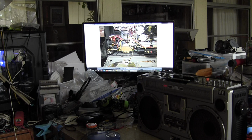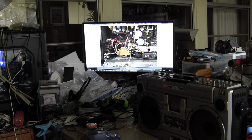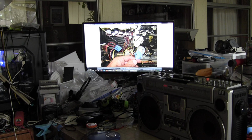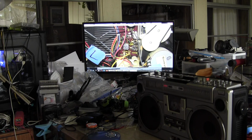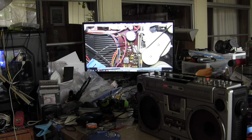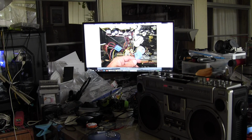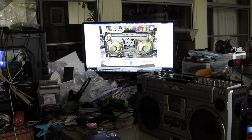Picture of this side where the wires go, because this is very important, because when you go to separate the main front from the back, you need to, anyway. Another picture just because. And then I labeled the two individual black wires that go to here. This is where your left and right wires go, and then up here, these are both the same color, so I labeled them myself, left and right, before I took them off.